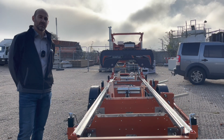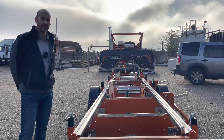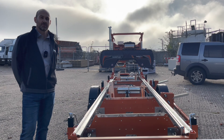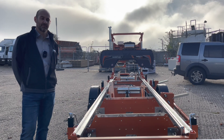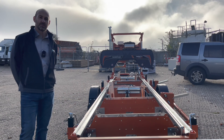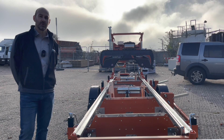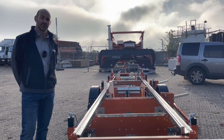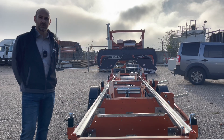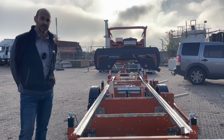Today we're talking about the HD 36 V2. Some of your basic specifications: it's a 36 inch capacity sawmill, so you can put a physical 36 inch round log onto the bed. The bed itself is 20 foot in length, which allows you to cut a 17 foot long log, and the maximum board width you can cut from this mill is 30 inches. You can get varying lengths of the bed — a two foot extension to increase the length, or a four foot permanent extension as well.